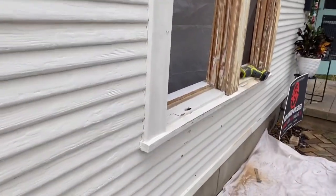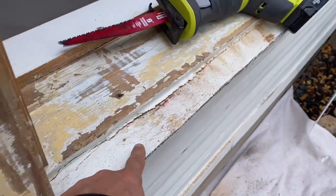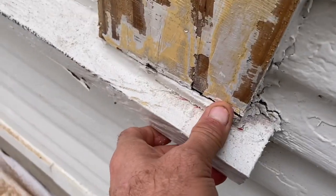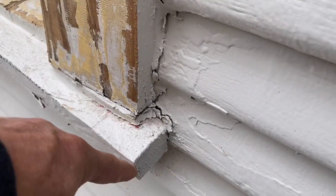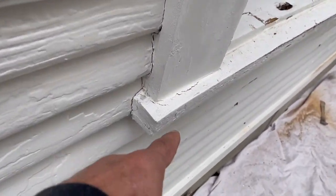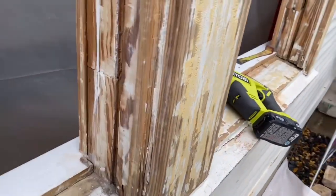On site here in San Antonio, we've got a window sill that is rotted. There's another board under it that I've started cutting. I'm going to take this sill out — you can see it's caulked here. It's super mega twisted, and there's no slope on this sill whatsoever, which tells me maybe it's not original. There is a big old honking nail holding it into the house, which is an indicator it might be original, but that's not a guarantee.